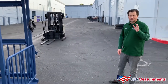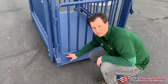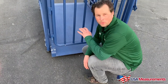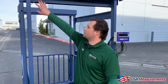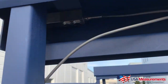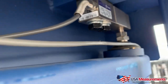What we've done different than anybody in the market is how we've built this scale. So traditionally, load cells — the weighing mechanisms — are actually installed underneath the platform. What that does is when you need to wash your scale down, that causes problems with the load cells. So what we've done is we've actually installed them up here into the upper frame, which makes this scale safe for outdoor use and wash-down applications with livestock.